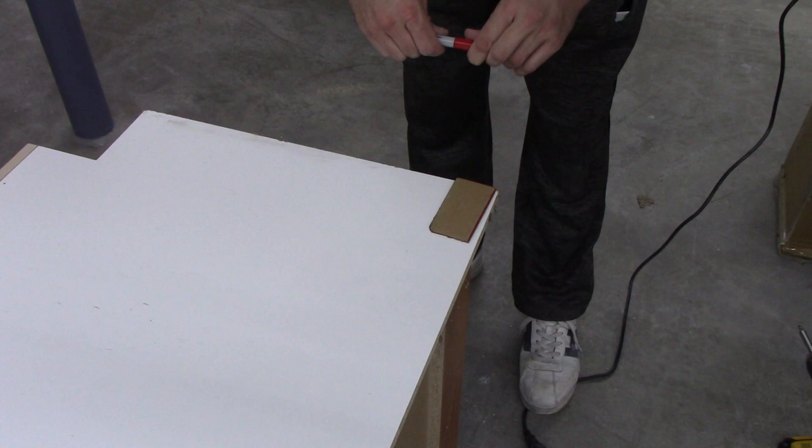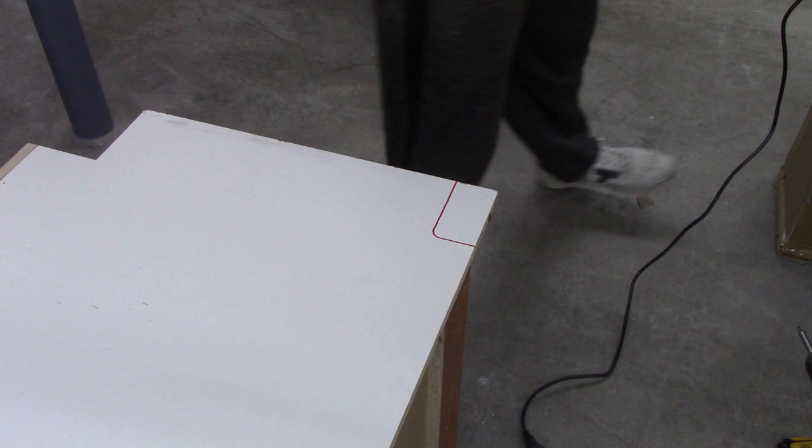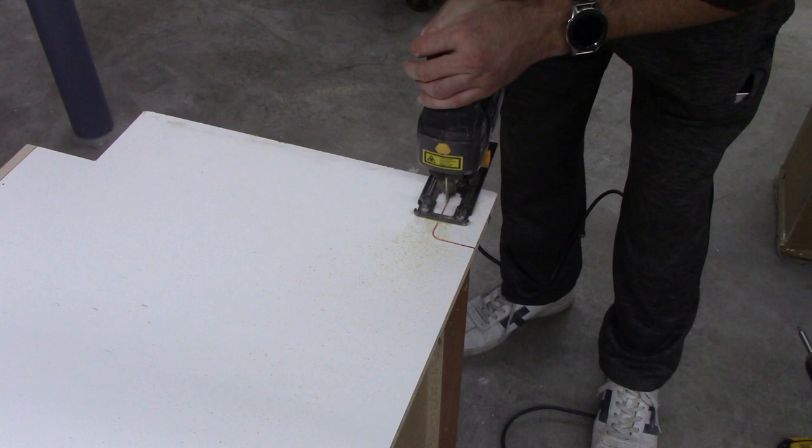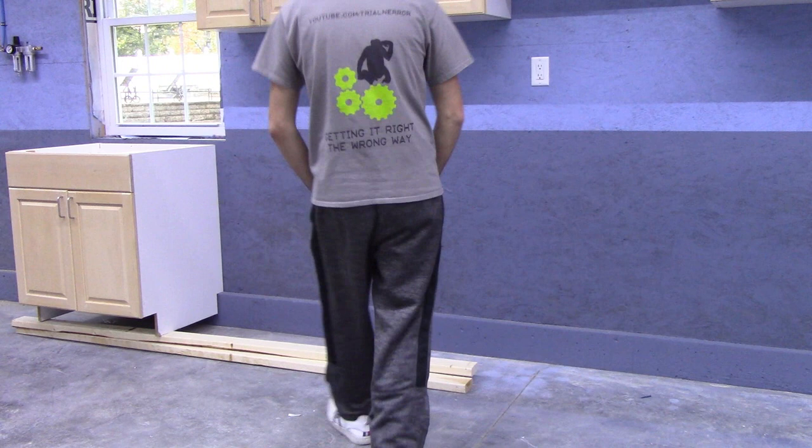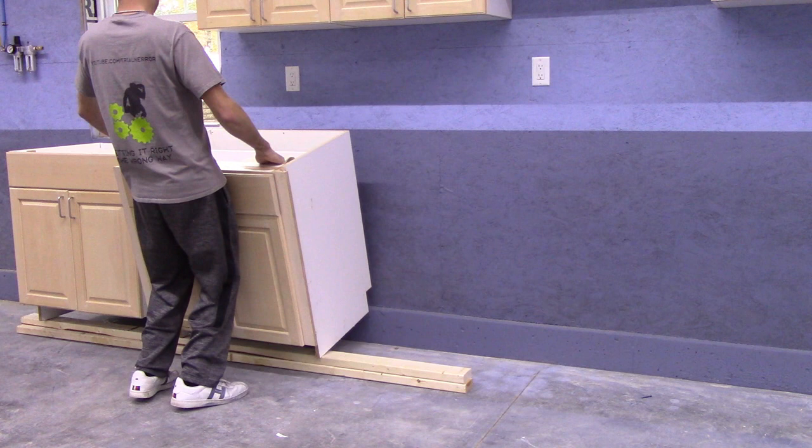For the lower cabinets, I decided to notch the back of them and sit them up on top of the foundation, which gives me a little bit extra working table height. At 6'2", having that extra working height is actually an advantage for me. And it allows me to put the cabinets up against the wall. Otherwise, they'd be sitting out about 2 inches, and then I'd have to do something with the countertop. This was just easier, and I like the higher countertops.